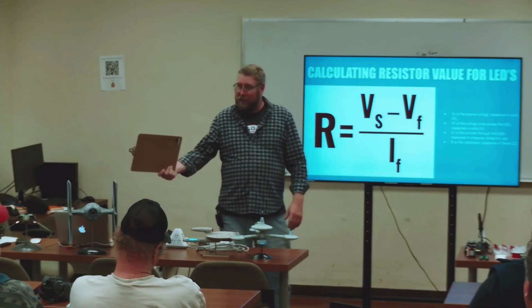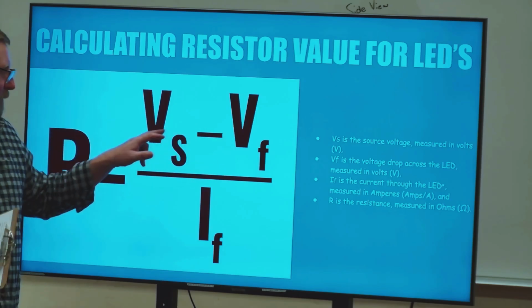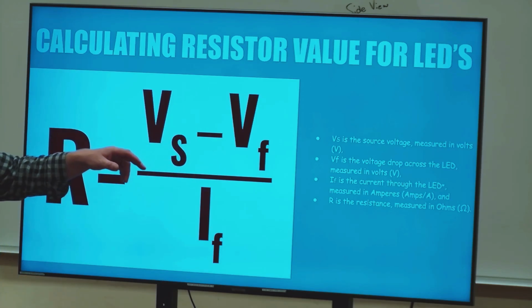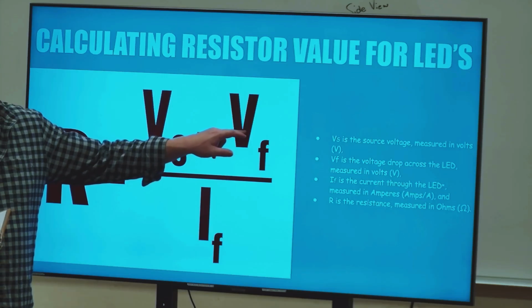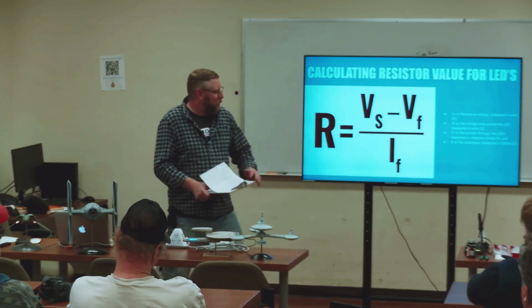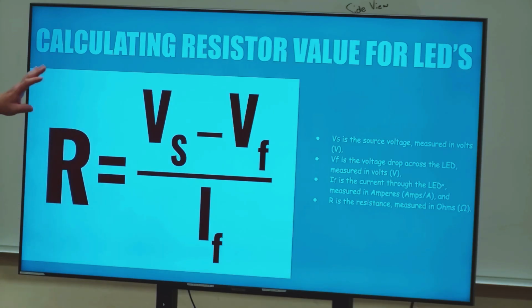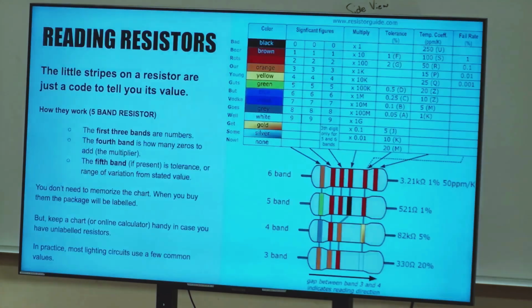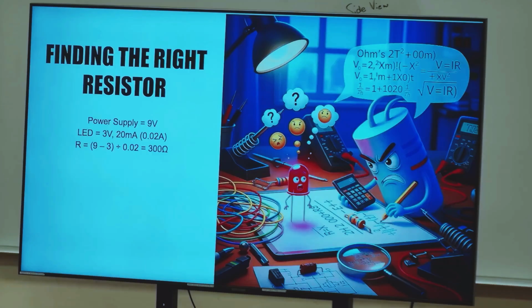In the case of these, for example, I've got 12 volts in, or 9, these might be 9 volts. Anyway, it's actually the same resistor for 9 or 12. Run 9 volts in, the LED runs on 3 volts, so I've got 6 volts left over, which I have to divide by the current, which is in milliamps. This was just for fun, because we're going to go much simpler now.